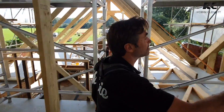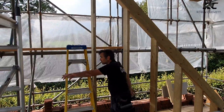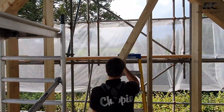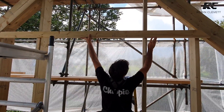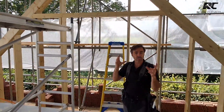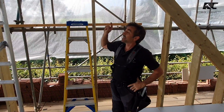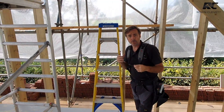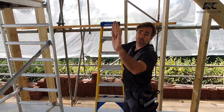These two lattices go immediately above my head — this pair goes in this section first, and then the long ones underneath go in that section. On this side we've got the basis of our gable wall in — it's a very big strong gable wall going down onto the solid wall. We've worked out roughly where the bottom of the lattice truss is going to be, so between us we'll lift it up, slot this in underneath to hold it until it's secured and fixed, then get the next one in. It's a two-ply, so once that's in we'll put the head underneath that supports it all. We can't have the support in there at the moment because it's too long and we can't twist it in.